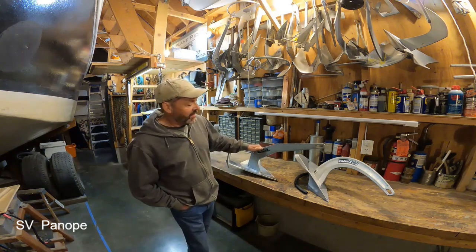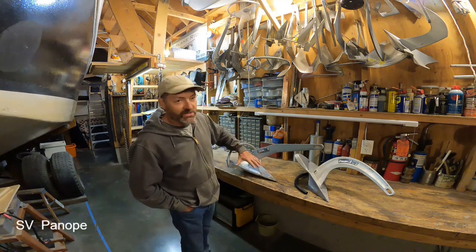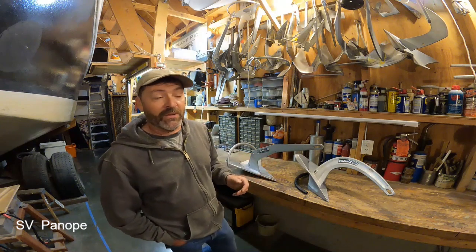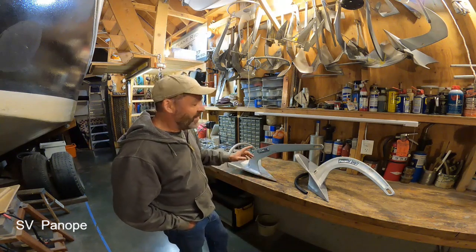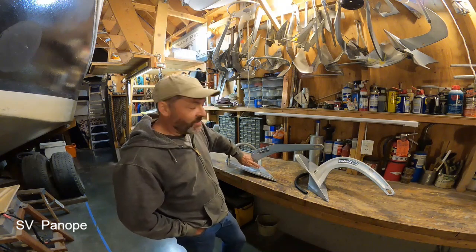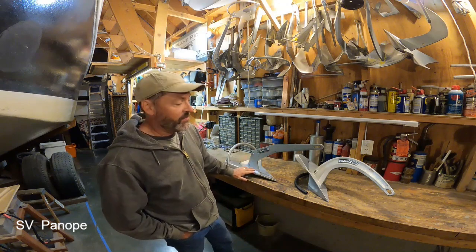This is a roll bar Rockna anchor and I've shown in many other tests where seabed that gets sort of clogged or choked up here in the fluke causes it to pop out and not make much holding power in some seabeds. So a theory would be, well, if we could sharpen this forward face or this leading edge, maybe we could get better performance.